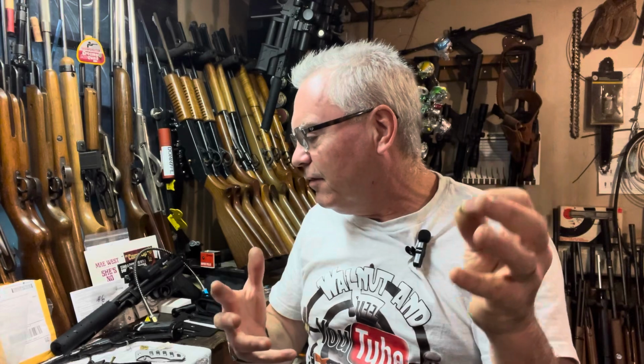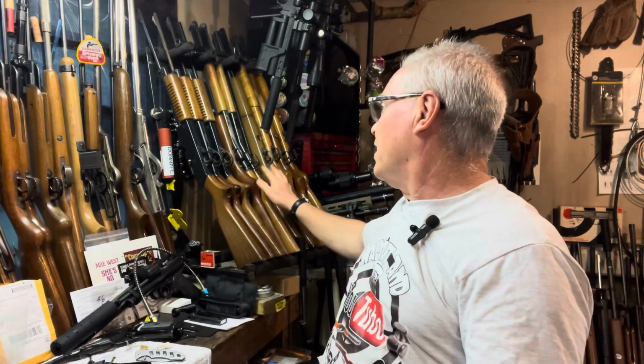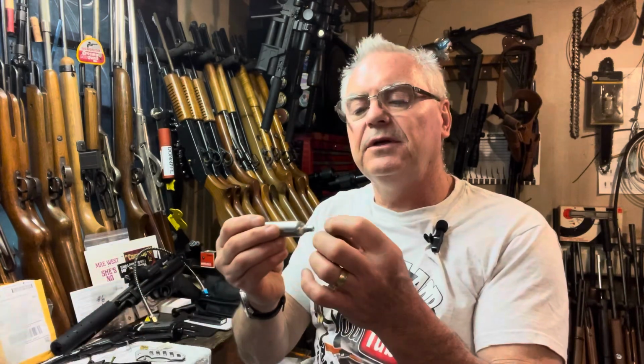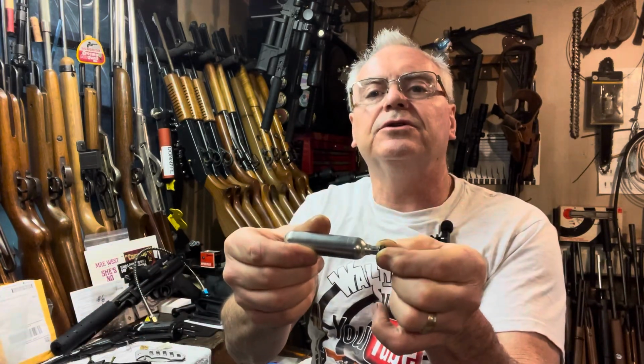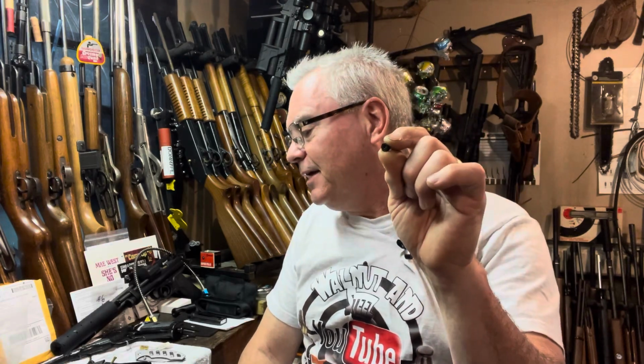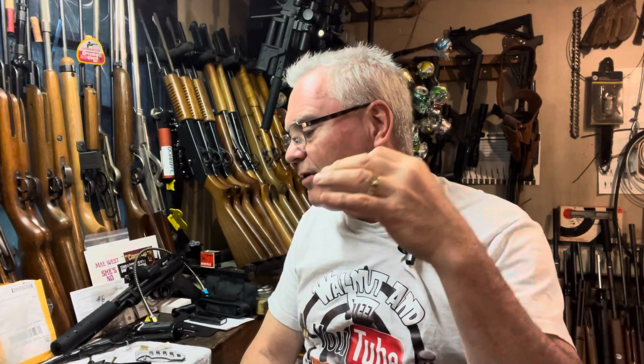black, I'm assuming it's rubber, I'm not really sure what it's made out of, but this black material seal that's part of Henry Ford's kit for the Crosman 101, 102 type of gun, for the valve inside of them, was an exact right fit for inside of that CO2 opening where you put your CO2 in and it mates up against the CO2 cartridge. So I did that a year or two ago with my 177 version here, and this is actually the seal